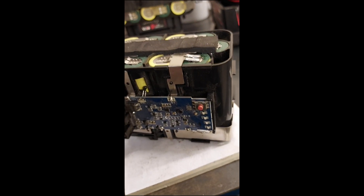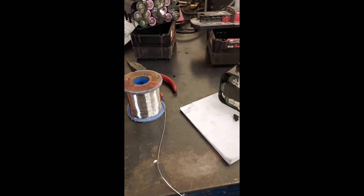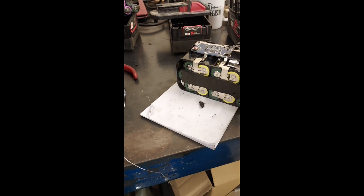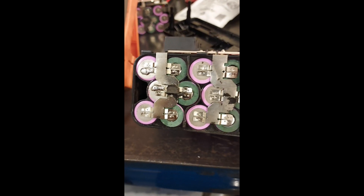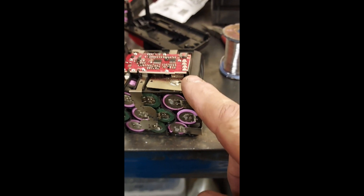Let's put them on charge and see. Interestingly, this one where I had to solder a broken cell - this won't charge, the charger just flashes as though it's a dud cell. The other one of this type is taking a charge. And this is the first one I did where I had to solder about five of them - this has now taken a charge.